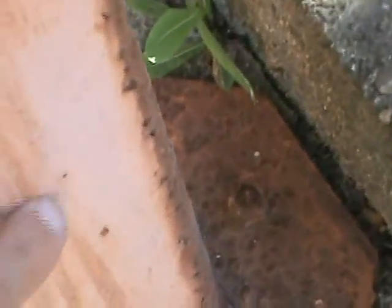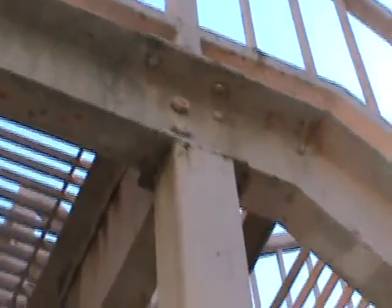We have one area here where there's one bad leg. We need to open it up, clean it up, fix it, and place a hole here so when water does penetrate from the top, which we're going to eliminate by sealing all these joints, but again, water has its way to get through things. You put a hole in here and water will just travel out of what's inside those poles. So in this case, we need to verify the pole structure and see if it can still be safe.